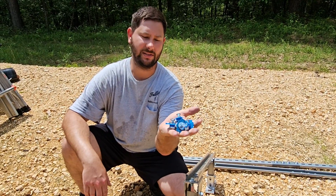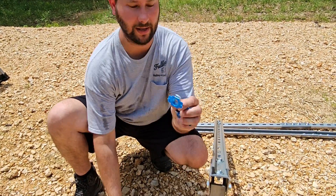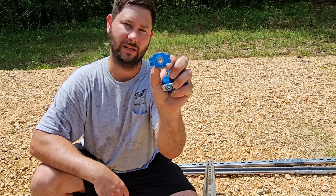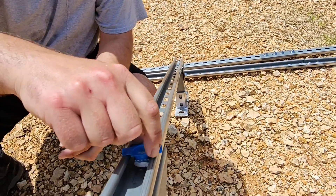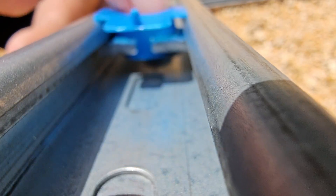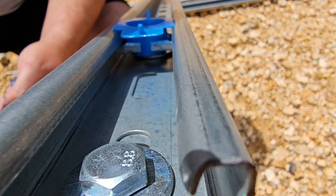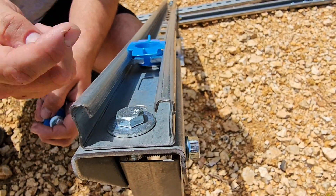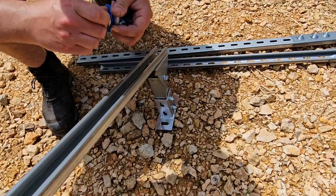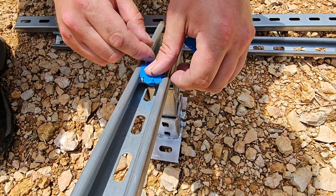These are flange nuts — I like to call them cone nuts. You've got a bolt and a washer, then a plastic piece, and below that a place for the bolt to screw into. You're going to slip this into the unistrut — one at the top, one at the bottom. It'll hold if you put it above that bolt, but it has to be turned so that when you start screwing in the bolt, it pulls the piece up and it's tight. We're going to put one at the top and one at the bottom in the same places on each piece.